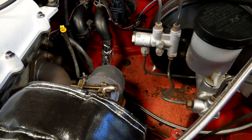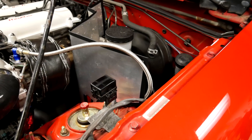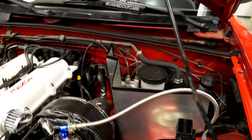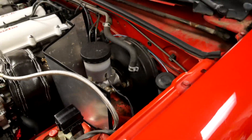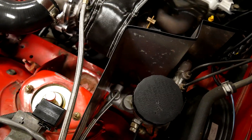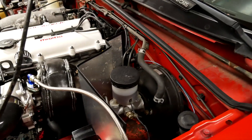To pick a good material for a heat shield, you'll want something that reflects heat — the radiation component of heat — something that blocks flow — the convection component of heat — and something that doesn't directly touch or conduct heat to what you're trying to protect. My choice of material for this shield was aluminum, since it's inexpensive, easy to work with, and it does a decent job doing what I just talked about.